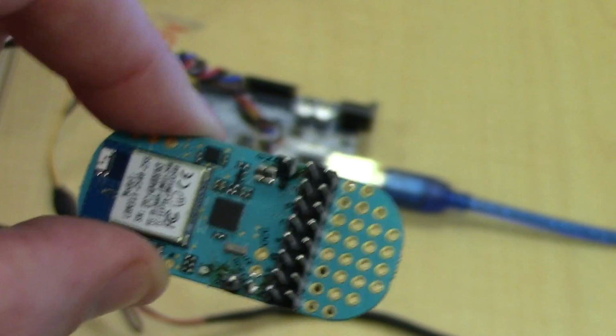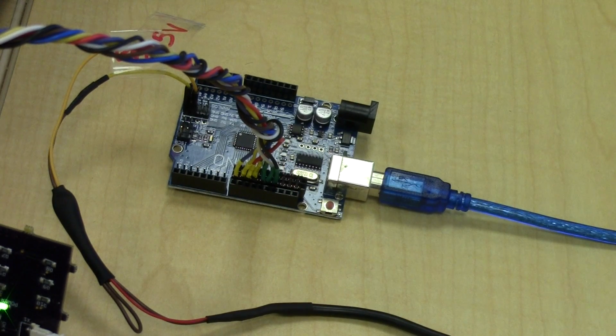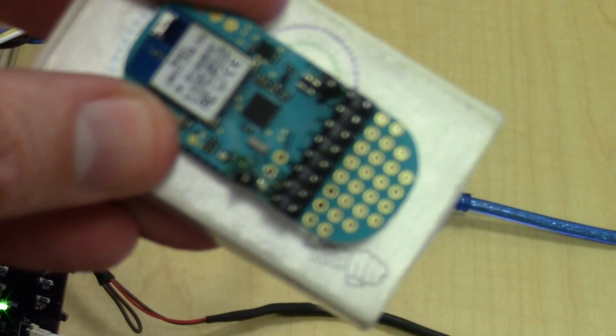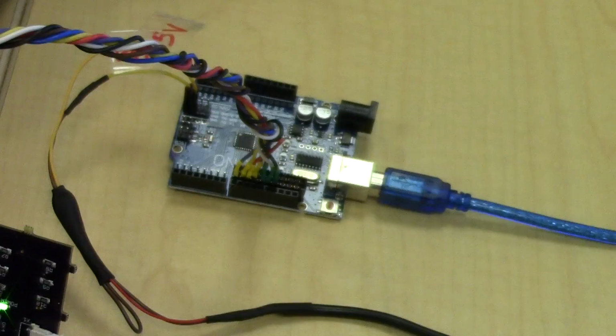As it turns out, after more testing, what I ended up doing was buying a cheap little Arduino Uno and hooking that up, which has USB power and actually has pins that are 5 volts instead of 3 volts. And that made all the difference in the world. Since I added the Arduino, there have been no more missed characters, which is too bad because I really did like the Bean and wanted to use that for a project. But now I have a Bean for other projects, so I will use that for other projects.